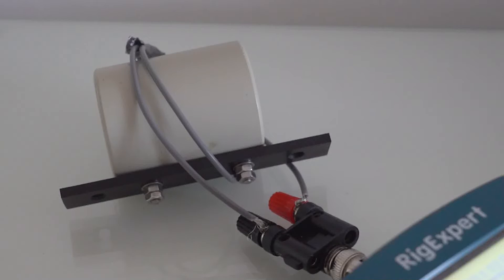You will need some means of measuring the resonant frequency of that trap — you can use an antenna analyzer and a small coupling coil, and there's a little video on the channel showing how to do it. Then you've got to weatherproof it. If you just want an antenna that covers two bands, you might want to just purchase the traps. If you want to make your own, it's great fun, not difficult to do, and not expensive — just need some wire, a coil former from a hardware store such as a bit of plastic pipe, and coax cable to provide the capacitor.